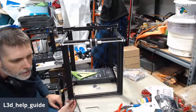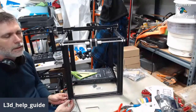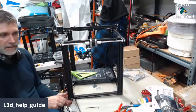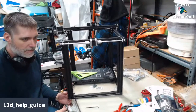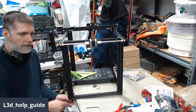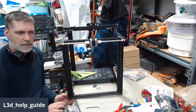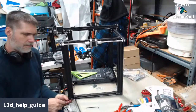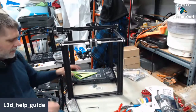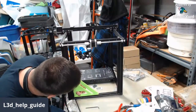No, 11 burrito. The build size is 50 millimeters more in the z-axis. So your Ender 3, the specs say 220, 220, 250, but it's actually 235, 235, 250. The Ender 5 series, the standards are 235, 235, 300. And then the Ender 5 Plus is 360, 360, 400, I think it is. Might be like 405 or something like that. It's a lot bigger, brother. But either way, a little bit extra Z height for you. This is the way the design worked out.